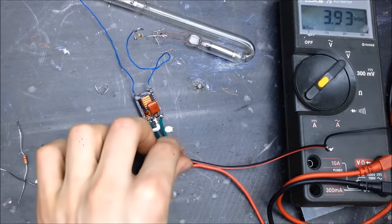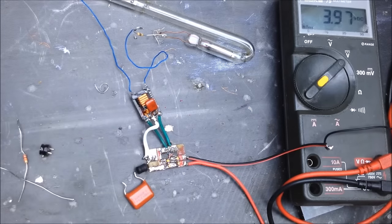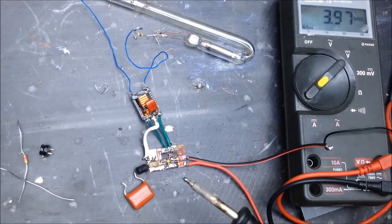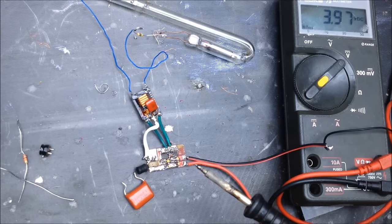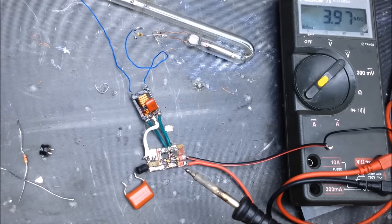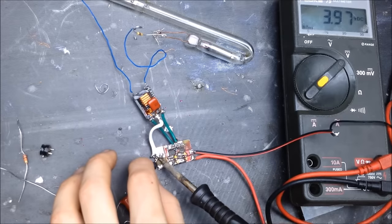See if anything is warm. Oh yeah, those MOSFETs are hot. So you can see right now off the bat that this is going to generate a lot of heat. I just checked it, and those MOSFETs are extremely warm right now. Okay. So I mean, you need a smaller cap or even a smaller inductor still to get that to run pretty cool.